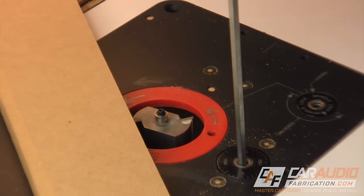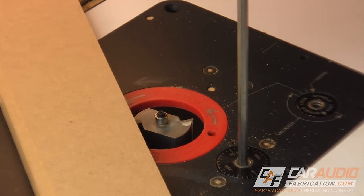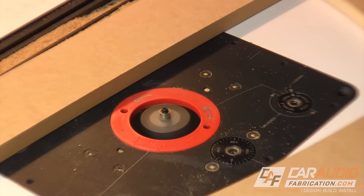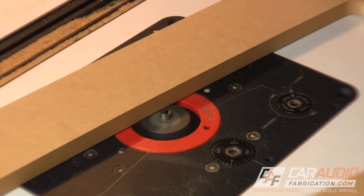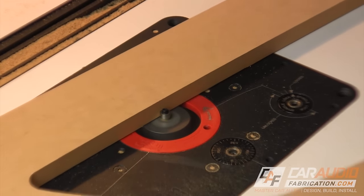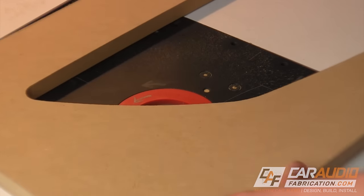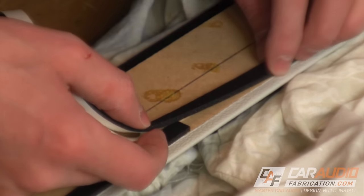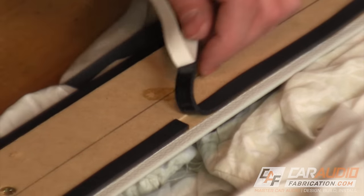Next, we need to do some router work on the backside of this window to account for vinyl material and how the window will make an airtight seal against the wood. I've loaded in a three-quarter-inch rabbeting bit. This bit cuts a step into the wood three-quarters of an inch in and as deep as I adjust the cut. I want to show you the finished project here so you understand completely what I'm doing. That cut gives me this edge, which serves as an edge to allow me to lay down the speaker gasketing tape precisely on the backside of the panel in order to seal the air within the subbox.